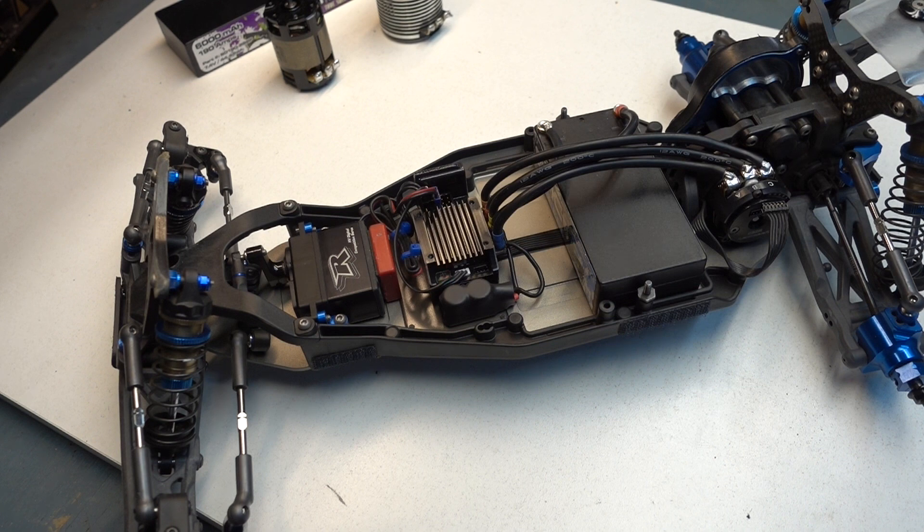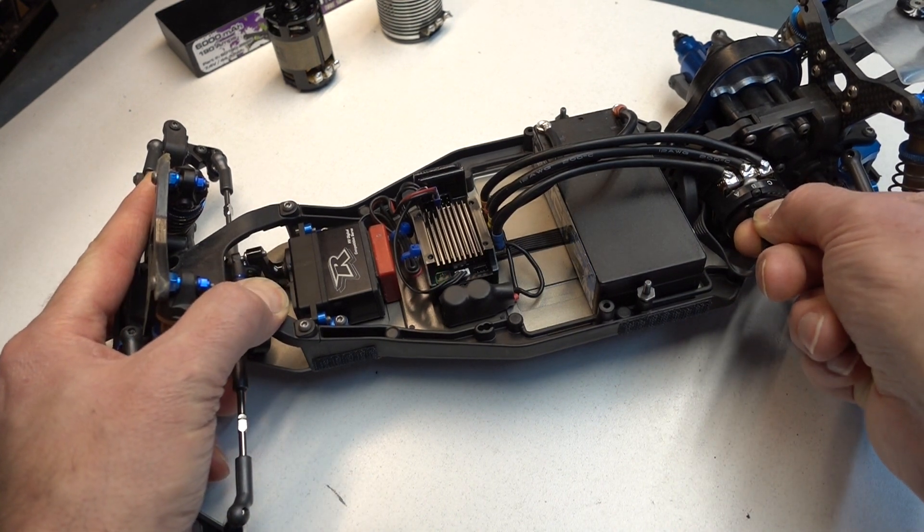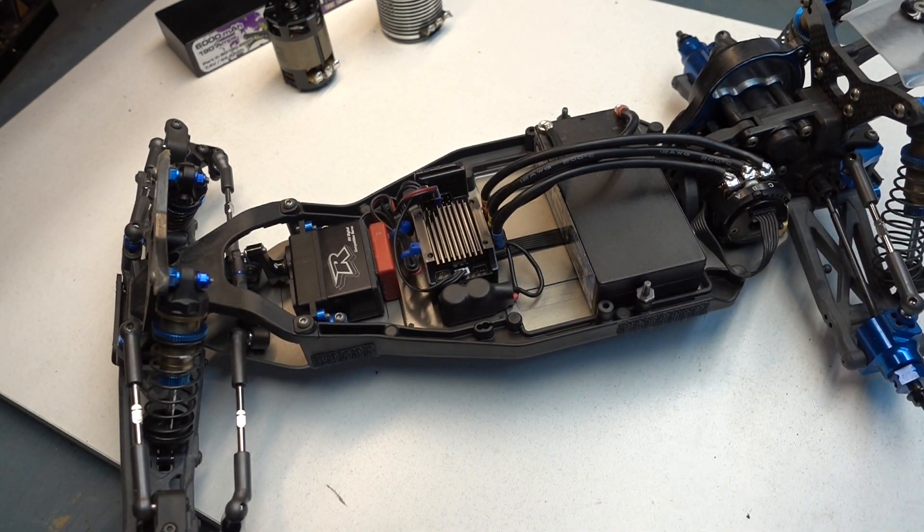It's just a question of making sure that our motor connection is correct. Here, as soon as I hook up the motor again, the ESC has read the sensors — you can see it's a dynamic setting. As soon as it reads from the motor it will start working normally.